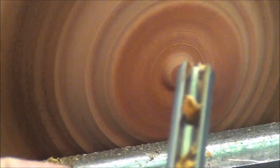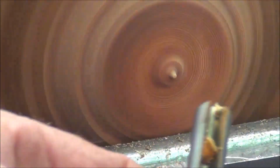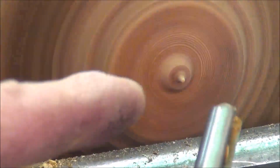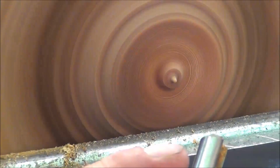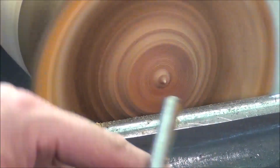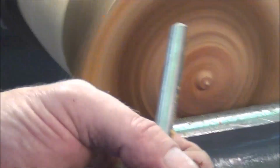I'm going to use the small gouge, the small quarter gouge with a standard English grind. The wings aren't cut back, just a standard grind. Drop it in the jig, the arm, and just roll it around. Lovely size tool, lovely tool for doing this. I'll start to use the largest tool, the 1/2 inch bowl gouge. As I get deeper, as the overhang gets more, I'll need a bigger tool with more integrity. This will start to flex and screech.